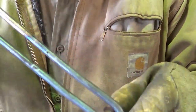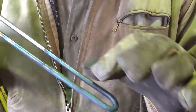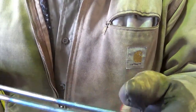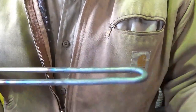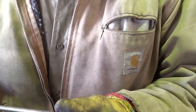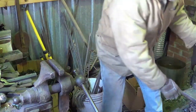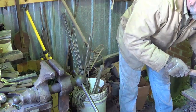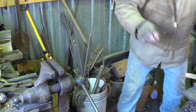About three and a quarter inches — a little over three inches, three and three-eighths, three and a quarter — from the point. I put two dimples in because that's where I want to bend for the start of the heart, because this length here is critical for the puzzle to work. It's better longer than shorter, so definitely — and for the way the puzzle looks — three to three and a half inches. Let's get that in the bender, find my marks, put that in the vise right on those dots.